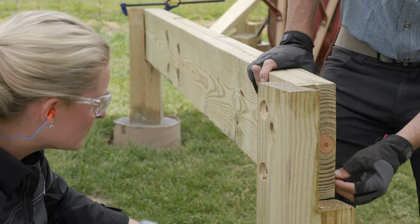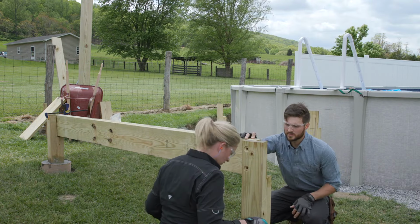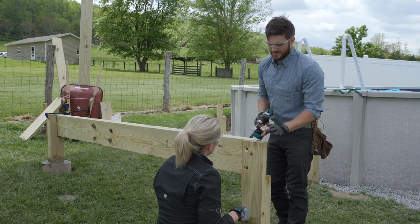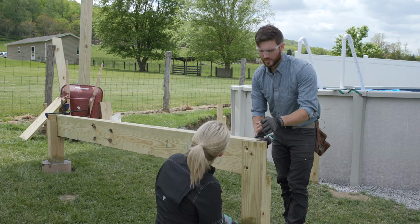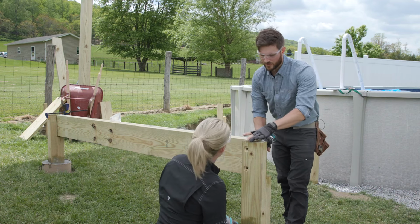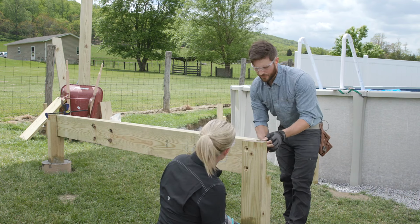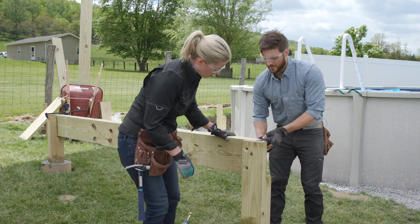All right, nicely done. Okay, so if you don't mind, give me that paddle bit on this side. I'm going to bore out just a little bit, but in this case, this is actually important. As this was just kind of decorative, this is going to make sure that I'm square with the front of my post whenever I really secure up that nut and bolt. All the way through, this is going to make sure that it pulls straight and not off to an angle for that washer. Okay, ready?